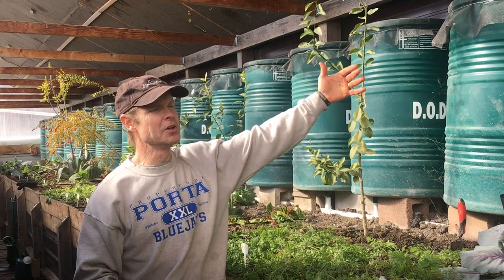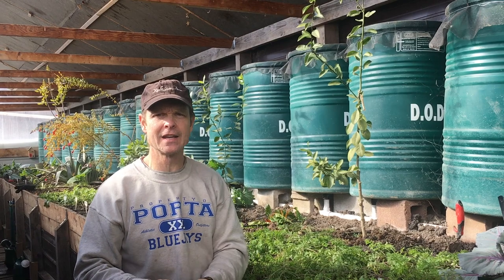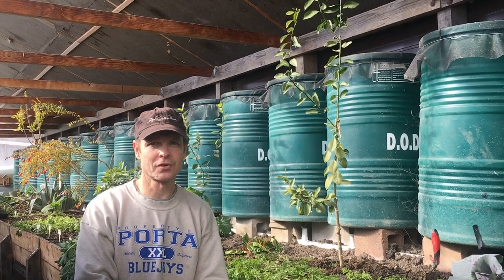When I lose 50% of my water, I've lost 50% of my heating capacity. About three hours of sunlight gives me a net increase of 80,000 BTU. For those of you who are engineers, that's like running a 1,500-watt space heater for about 16 hours. That's a tremendous amount of heat gain these barrels get. But if I lose the water out of them, I either get zero, or if it's half full, I get half of that. You can see how important that water is — leaking out really destroyed us this time.